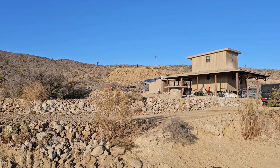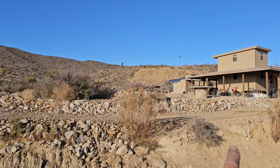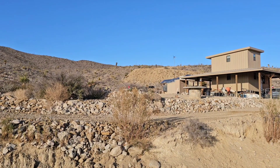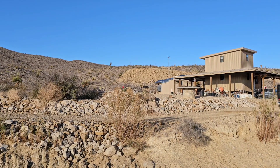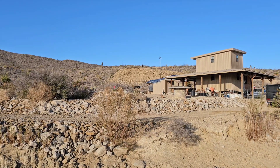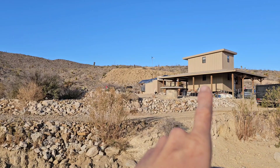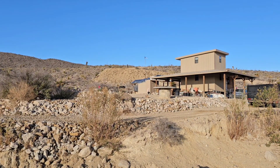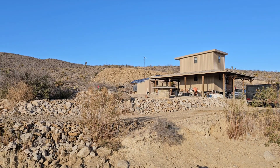So that's going to be my water system. Rainwater runs down off this mountain, fills the pond, filters through the gravel bed into the well. From the well I can pump it into the 30,000-gallon storage tank. I'll also have that 600-gallon tank at the ridge to establish water pressure. The most efficient way is to pump up one time to fill that 600-gallon tank and let gravity do the work, instead of the pump kicking on and off to maintain pressure in your lines.